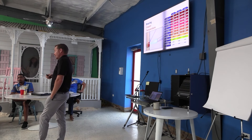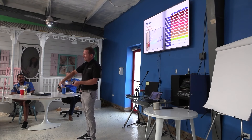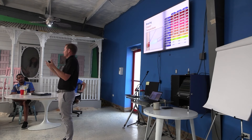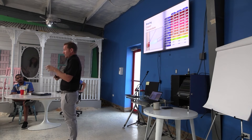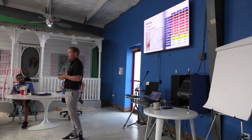Use a mirror when brazing — not your phone (solder drops will destroy it). They make mirrors with LEDs; polished steel or aluminum mirrors hold up better around heat. When brazing indoors, best practice is to have a small bucket of water with rags, a small fire extinguisher, and a mirror. That keeps you safe — if you start getting into trouble, you've got wet rags and a fire extinguisher ready. Inspect your work with the mirror every single time.